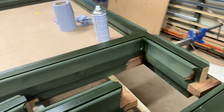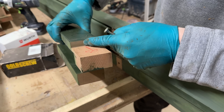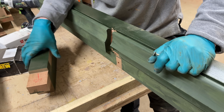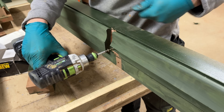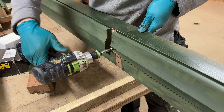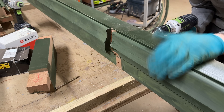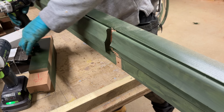I want to get a really accurate screw into this shoulder on this rail. I'm drilling it from this side through the rail. The drill bit's not long enough to go all the way through, so I'm going to wind the screw through as deep as the drill will go. Then once that pokes out the other side, that's the centre mark for my drill bit to drill back in the other direction. I've got myself a pilot hole.